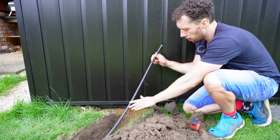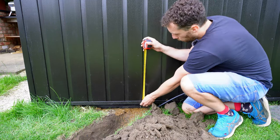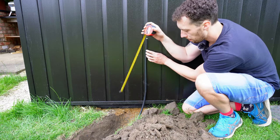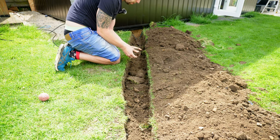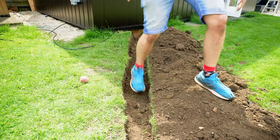Right here is where the cable will be connecting into the workshop. It needs to connect in 450mm above ground level. That's 600mm there, so I've got a little bit to play with for the electrician. As it's covered, I'm going to push in a load of soil, and before we put in all of that remaining soil, we're going to stamp it in with our feet just to make sure it's nice and compact.